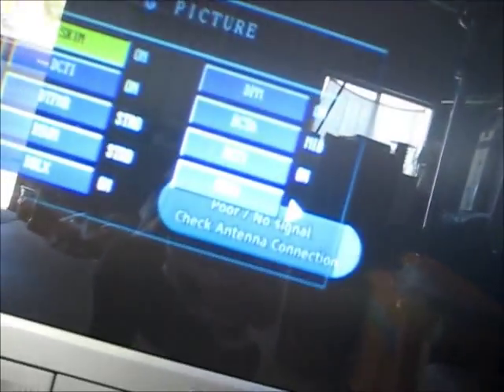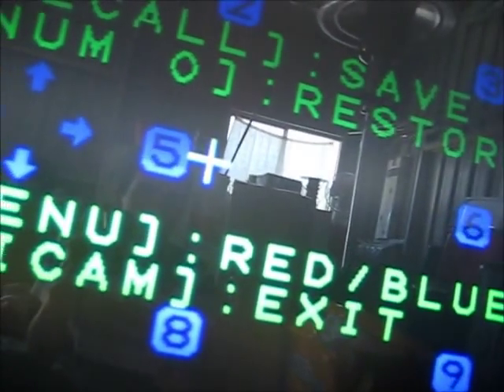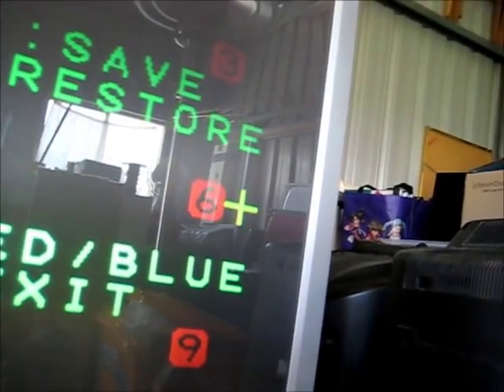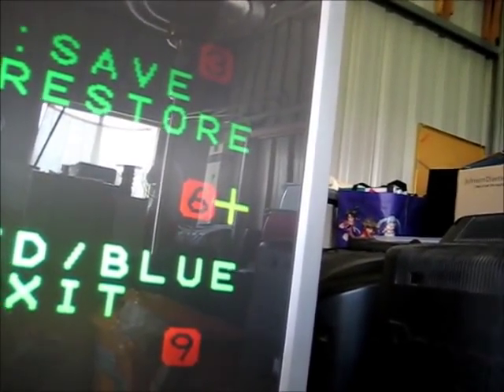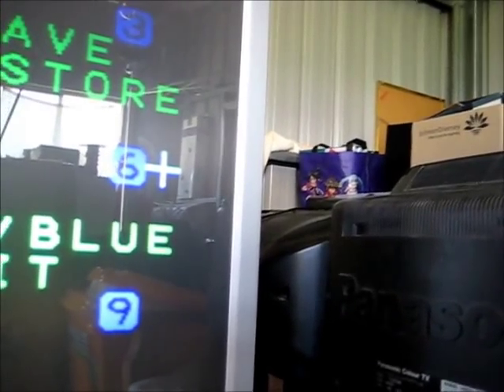If I go to menu — advanced — that's the HD resolution there. The picture's looking beautiful now. It's a little tiny bit out because I only used the smart focus feature, which programmed them. But now I've got to touch it up on this input here with the convergence.